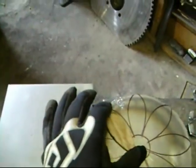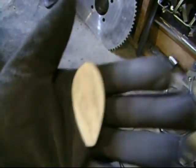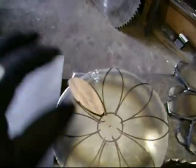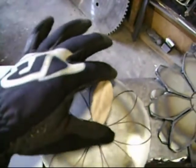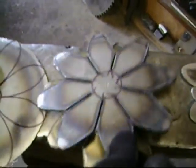First, I made a little stencil of a petal here. I lay it out. I cut out the circle to the diameter that I want, and then just put the little petals on there. Then next, I'll cut out the rough shape here with a grinder and a cut-off wheel,